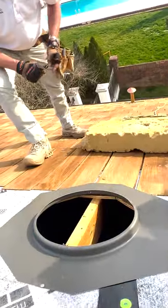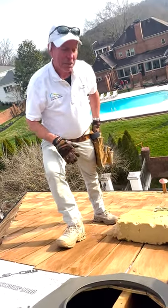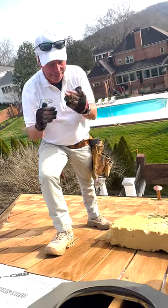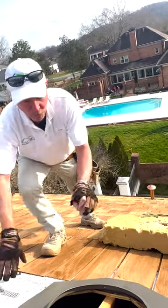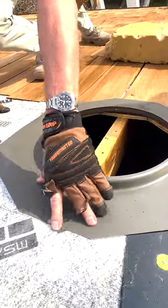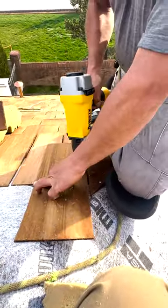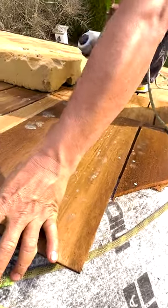This is the base for our turbine vent and I've strategically set this to a height where the shingles are going to work out so I don't have to worry about a gap. This being too short for a gap — it'll have roofing under it. The next row will fill that in right here.